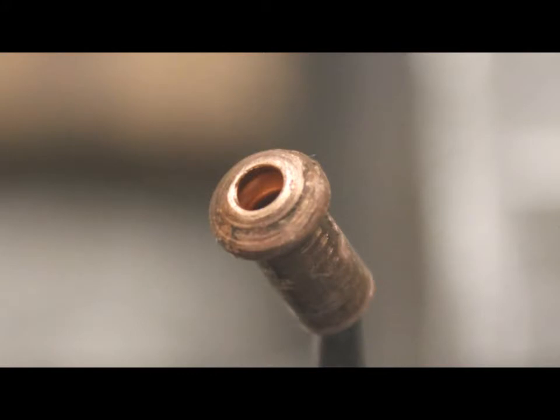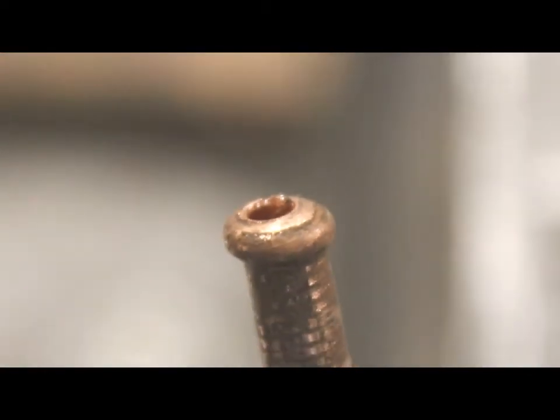This is why it's important to make sure it's 4mm. As you can see in this picture, you've got a perfect dome. This one you can see it's 3mm — the hole is not in the centre, the dome is not completely formed right. This one was set at 5mm. As you can see it's really, really lopsided, well off centre. So yeah, you have to make sure it's 4mm at all times.